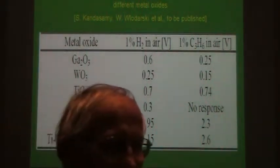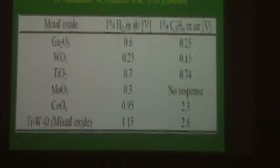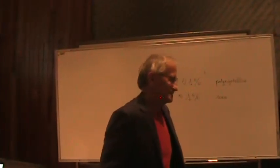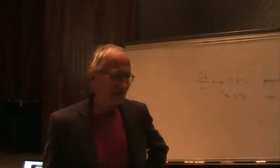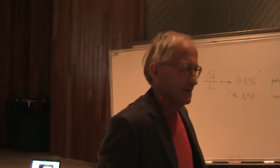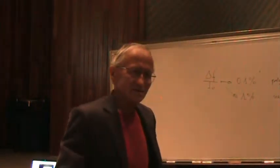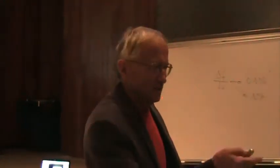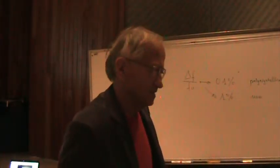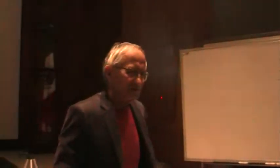So, my suggestion is, it's a funny story, I tell you something, practically what we observe, all semiconductive metal oxides and all conductive polymers are responding to hydrogen. Yeah? So we can try, hopefully, to deposit zinc oxide on silicon carbide, and we can test the response to both gases, in propane and to hydrogen in my lab, yeah? And my advice is you can install your own hydrogen with concentration up to 1%. There is no safety issues. We can also try, but we'll discuss this after lecture.